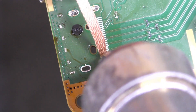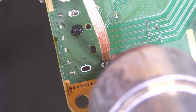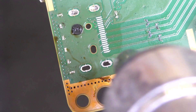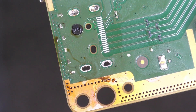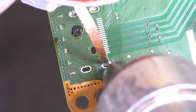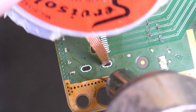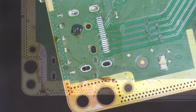There should still be some residual heat in the board making this slightly easier. After a few seconds, offer up the braid to the hole. Once the solder starts to melt, the braid will drop into the hole. The heat and flux will encourage the solder to absorb into your braid. Work the braid up and down steadily for a few seconds and remove the braid. You may need to repeat this a couple of times per hole depending on how much solder is stuck in there. If your braid is saturated with solder, trim the end, re-cut your wedge and go again. As you can see here, we've got that hole beautifully clear in double quick time.